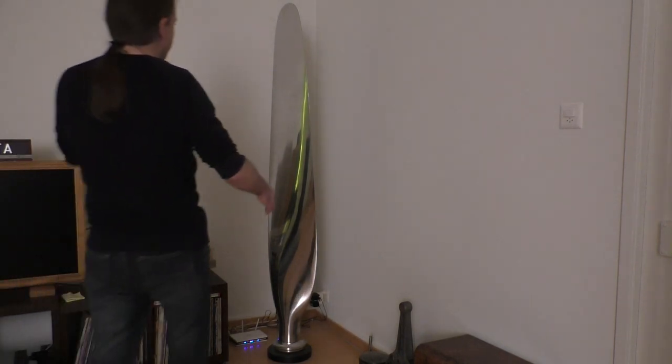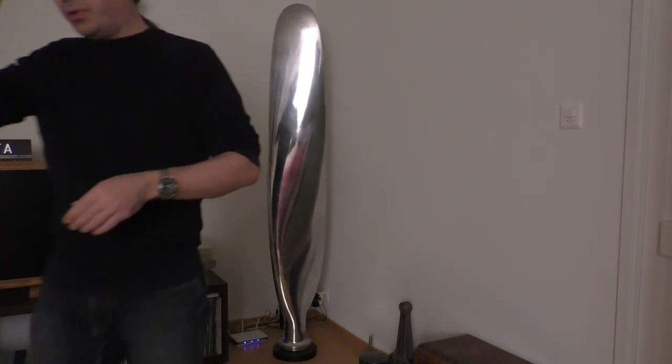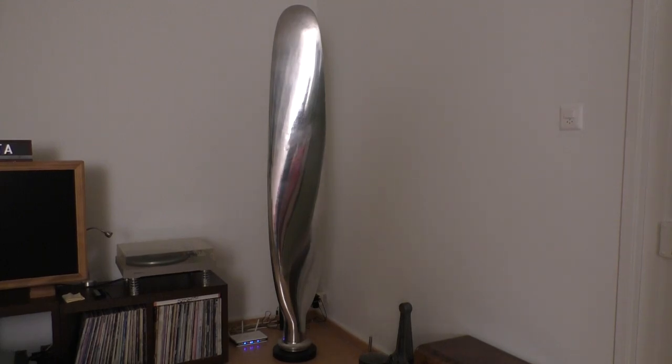Now the problem is you cannot regulate the speed of the engines just by opening and closing the throttle. That would not be accurate enough. So you set the throttle to a certain manifold pressure, to a certain amount of horsepower, if you want. And then you adjust the blades to create more or less thrust. And that will speed up or slow down your engine because it has to move more air or less air. And with this method, you can fine-tune the speed of the engine during the flight.